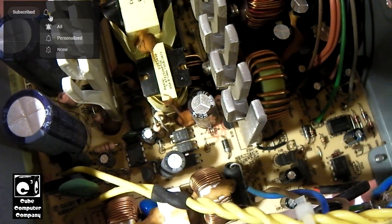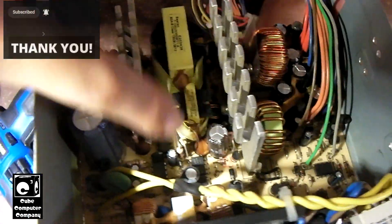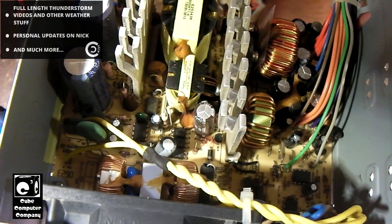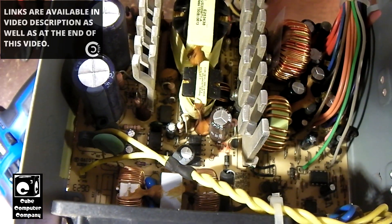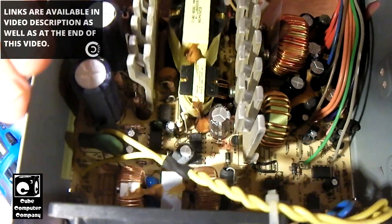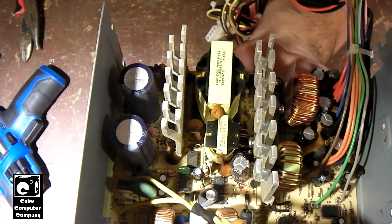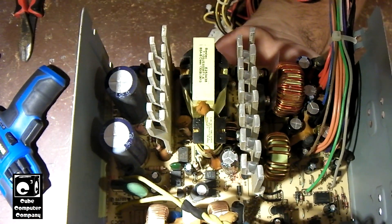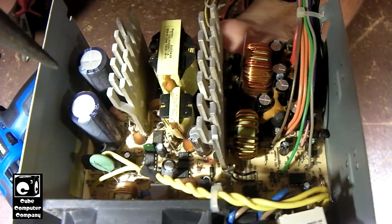You may be able to see a dark spot in the glue. When that glue gets dark, it can become corrosive and also it can become conductive, which is not good for something like this. I have actually done a couple of videos in the past of removing glue in these units, at least the tan glue in trouble spots.